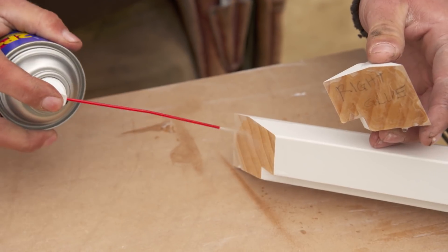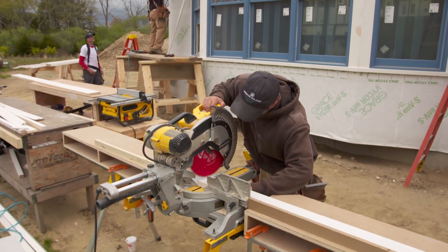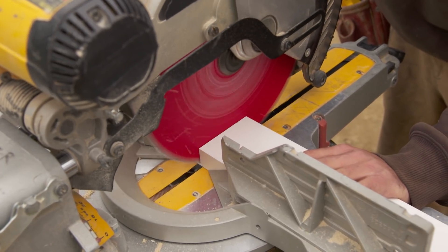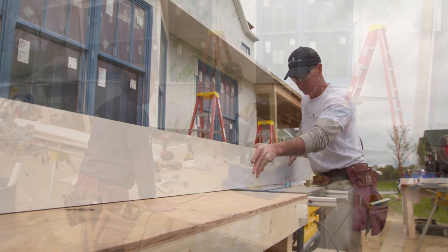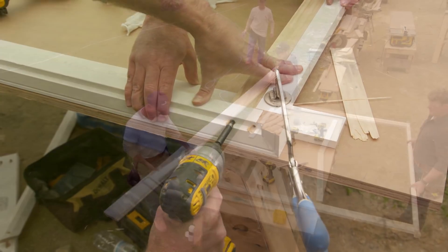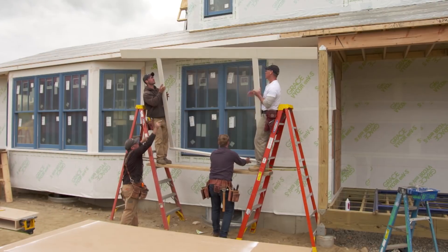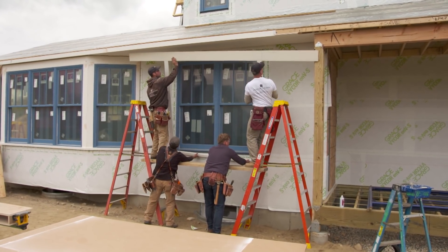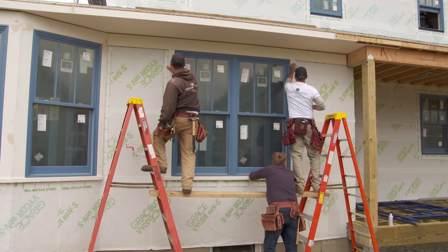Apply the activator and that's it. Now we can cut our legs. We'll drill for our pocket screws. It fits pretty good at the bottom, and up top too — looks good. We're just going to drive it in with an eight-penny ring shank nail.